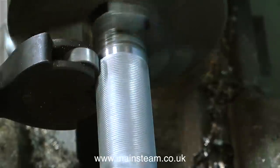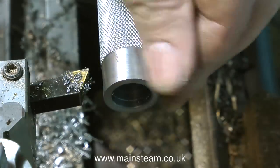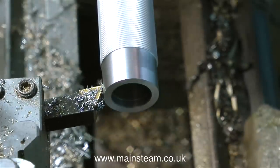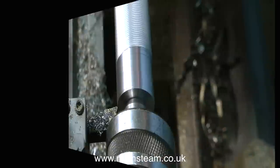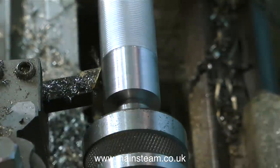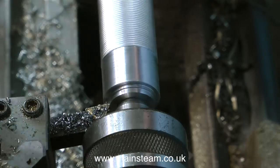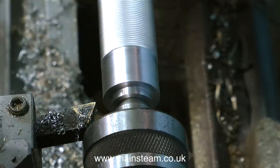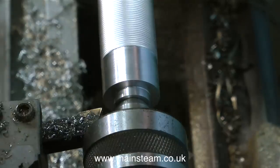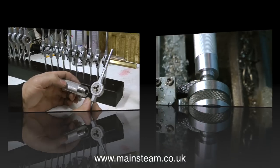The good news is I'm nearly at the end of the job. All I need to do now is clean up each end of the part. This part of the job is strangely satisfying. This is not really necessary, but it will make it look like a piece of professional equipment. After completing the clean up of this end, I turned the part round in the chuck and fitted the live centre, because this end of the work needs to be accurately machined — the live centre makes sure that the end of this piece of metal cannot move. The lathe is not in back gear and the video is running at 800% again, eight times normal speed. I keep removing the live centre and using the die holder as a gauge. One final, very fine cut does the job.